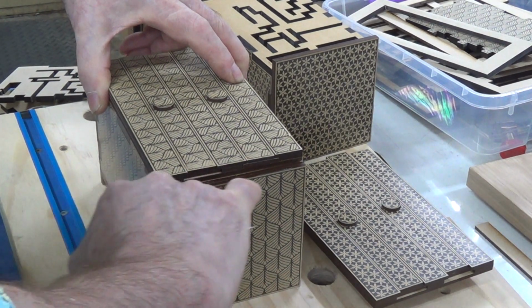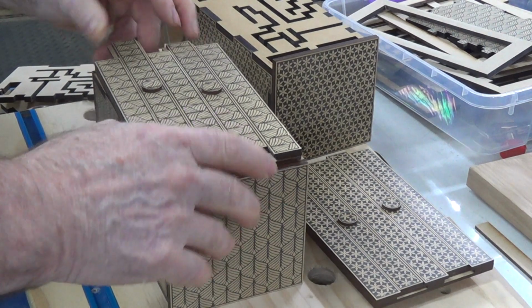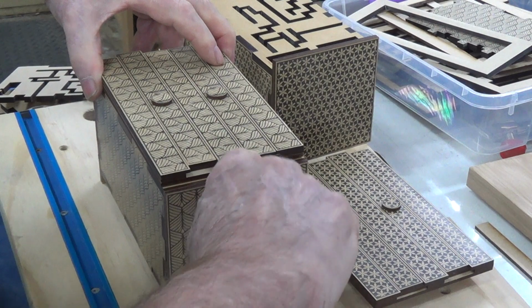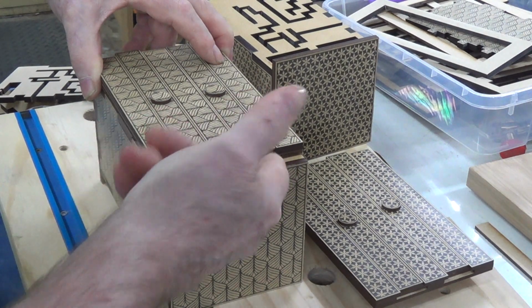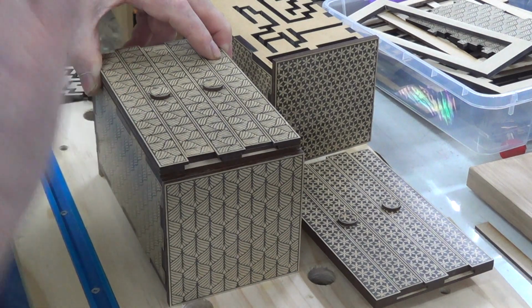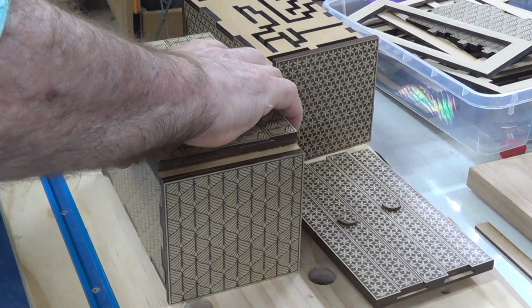I've allowed 2mm, although it's a 3mm thing. I've allowed that extra mil for that extra play, a 1mm extra clearance of that thing, and I'm hoping the 2mm will be sufficient to captivate that bottom layer, because that's always static, so it can't move sideways and it's got to stay there. That is the intention, and that has been really the main concept of version 3.